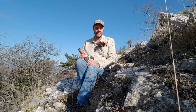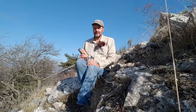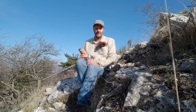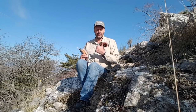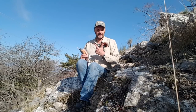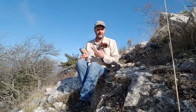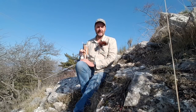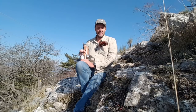It shows you that, hey, you don't need a big amplifier, really. And if you think you do, go watch my other videos, because I don't know what to tell you. You need three things to be successful: the right location, the right antenna, and the right time. Power isn't part of it. A little bit, but you don't need that much. In this case, a simple two-element Yagi and 4 watts in FM did the trick, 520 miles.